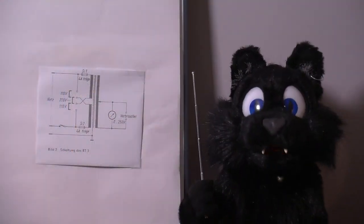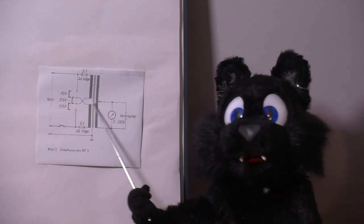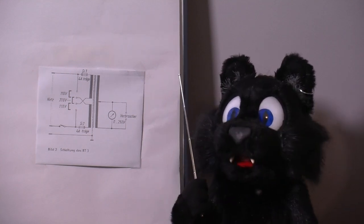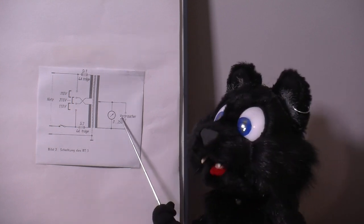The device contains two primary parts in that toroidal transformer: the actual transformer and a Variac combined into one unit. A Variac alone doesn't provide isolation, but I checked — there is nothing connected between the mains input side and the output.